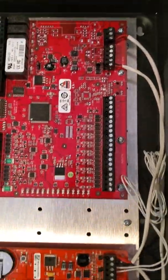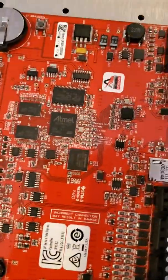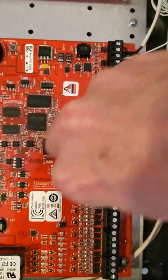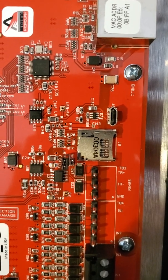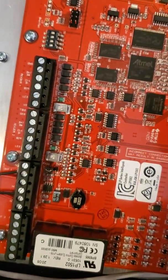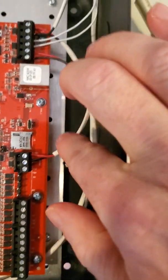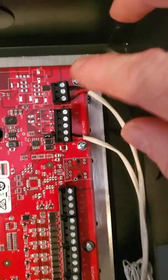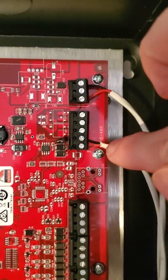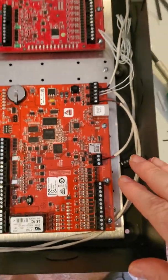For communication, we use RS-485 — that's simple enough. That comes off of this board right there. You've got your RS-485 TR plus and TR minus. Don't worry about the ground — we only need two conductors. I pulled the Phoenix plug off by accident, but that's okay. Take your TR plus and TR minus right up here to TR plus and TR minus on this board. There's your communication, there's your power — these boards are ready to rock.